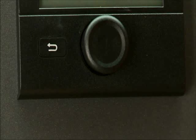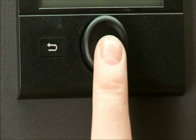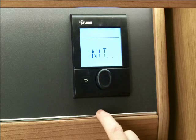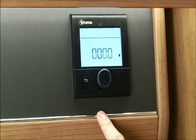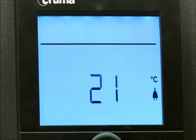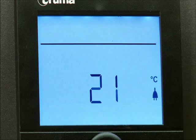In the center you can see the main control knob. Pressing this once for around three seconds will turn the control panel on, showing you the start or standby screen. The same procedure is used to switch the panel off. You will see in the center screen the current room temperature selected. The display will alternate between time and room temperature, and at this point we suggest that the first thing you do is to set the time.